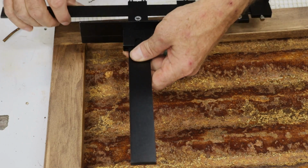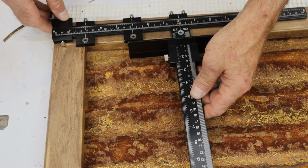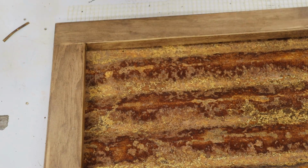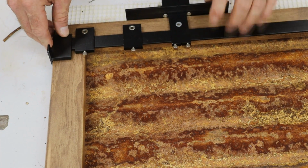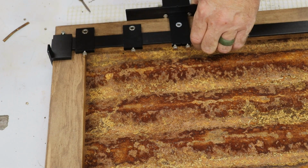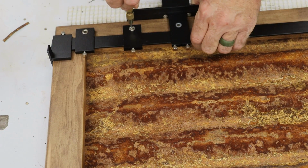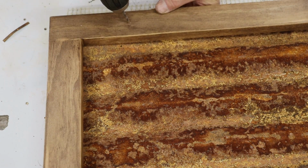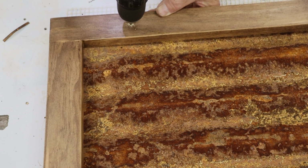I'm just going to make them out of wood. But I am going to use this positioning jig just to position the handles on the face of the doors. That way I'll be consistent on all doors. And then once I punch out the hole locations, again, you just use the jig and hold it tight against the bottom and the edge of the door. Then you can mark out your punch locations and then screw them out with an 1/8 inch drill bit.